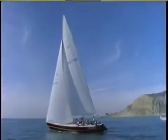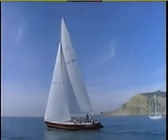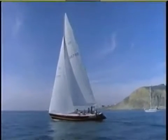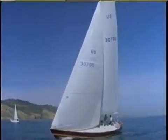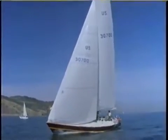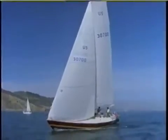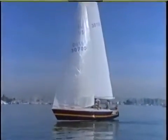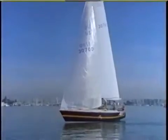At the other end of the wind spectrum are those awful conditions when there just isn't enough wind. Today, the quick way through these times is with a superlight Genoa made of a mylar reinforced material. Because of its low stretch properties, today's mylar Genoas can be carried safely over a much wider wind range than its Dacron counterpart. But even the light number 1 Genoa might be too heavy for true drifting conditions, and a change to a superlight mylar drifter produces instant results. This 3/4 ounce mylar Jenny is easily filled and assures a full, efficient shape in a whisper of air.